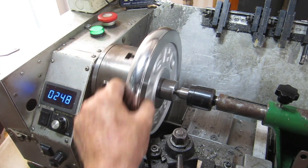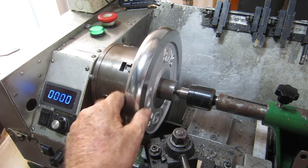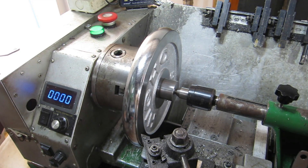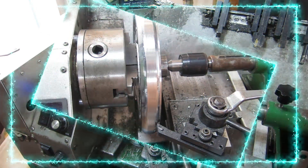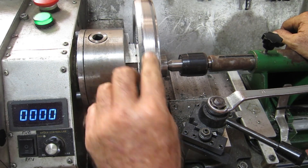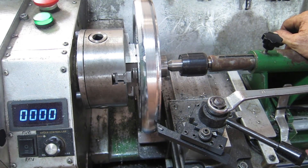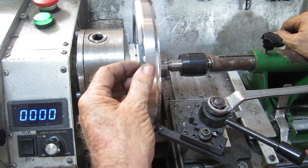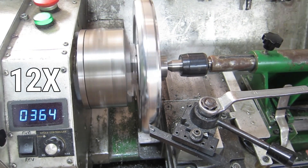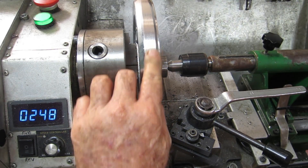I might have to put a different tool in so I can come at it this way a bit more. It's taking too deep a cut at that speed. I've got a left-handed version of that tool in there — seems to be doing the job. But I'm looking at what I've cut off and either this coating is really thick or this isn't cast iron at all. I claimed it was cast iron — it might be steel. I bloody hope not. Anyway, keep going. It's spraying that everywhere — that's not looking good, that doesn't look like cast iron to me.